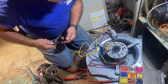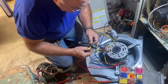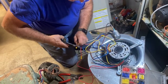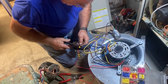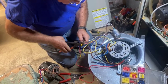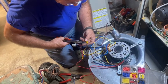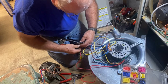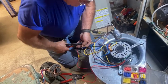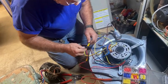Okay, now we've got high speed, which is black on both motors. These automatically flip between high speed and low speed for heating and cooling. You need a higher velocity and volume of air for air conditioning because cool air is so much heavier than warm air. So you run the blower on low speed in the wintertime. Now with new furnaces, everything comes from the circuit board and you can select the speed you want for heating and cooling in the middle range.